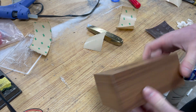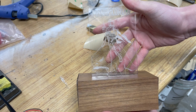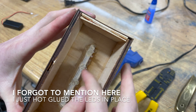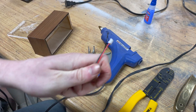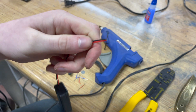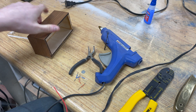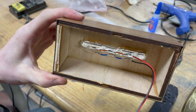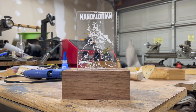Now I'm going to hot glue the acrylic in place. I've got to wire up the LEDs — I'm just going to bridge straight across on the positives and bridge straight across on the negatives, then stick this in. I need to cut off the little connector and wire this in. I'll jump cut to the end of the soldering. Got my really ugly solder job, but the lights turn on and off when I flip the switch. Big reveal in 3, 2, 1.